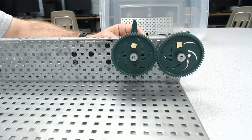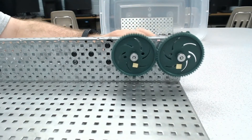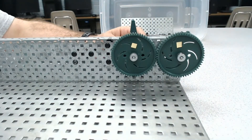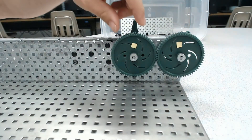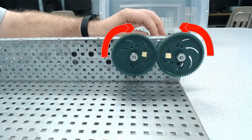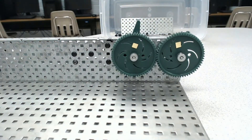Another piece to consider is the direction of travel — can this handle be turned both ways? Here I'm moving forward, but I can also turn it backwards, which means the direction of travel is also reversible. One last piece of information is to think about the gear direction: which direction does the output move in comparison to the input? You may notice that the output gear turns in the opposite direction of the input. That's useful to know because if you're going to build a device that uses a simple gear, you need to realize that the output and input go in opposite directions.